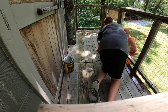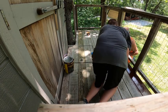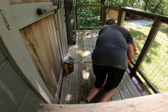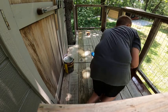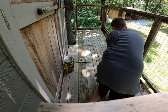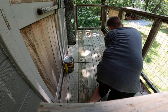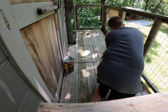Okay, now you only want a little bit more because you just have a little short piece. So just bear, now keep rolling it till you get it all around that roller. Start the far end and come in. Now you got way too much on there. Roll off as much as you can. Roll hard. Move your brush to the left and your roller to the left and to the right.